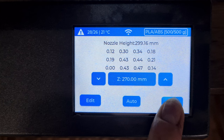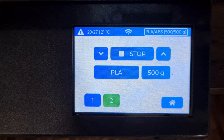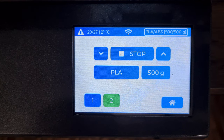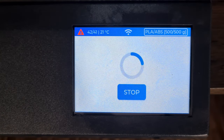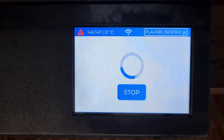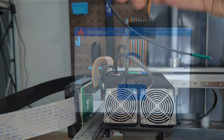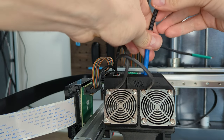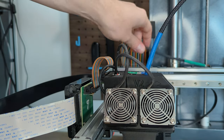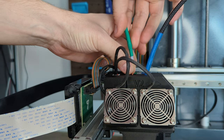Next up, let's load filament to the two extruders. We go into the material menu, hit extruder one, PLA is OK, and hit the down button — the extruder starts heating up. When the heater reaches around 205 degrees Celsius, the extruder starts running. We push the filament into the blue extruder path and wait until we feel the extruder pulling the filament down. After that, we repeat the whole process for the second extruder and we are ready to print.